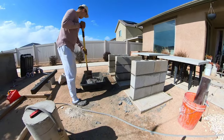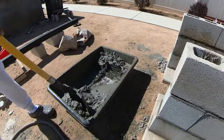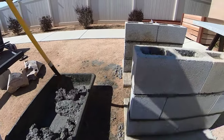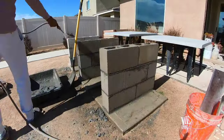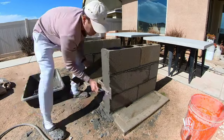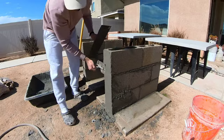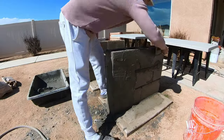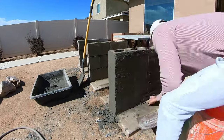After I left the concrete to set, I came back to add the stucco. I'm using the same Type S spec mix for the rendering. Always when you're adding the stucco onto your cinder blocks, make sure you hose down the wall first. This helps get rid of any dirt, but it also helps provide some moisture so the concrete doesn't dry up too quickly. Spraying the cinder blocks also helps the mortar stick. You'll have to play around with the mixture consistency — you want it wet enough to spread, but if you add too much water, it'll just fall right off. Try to err on the drier side, and you can always add a little more water if needed.